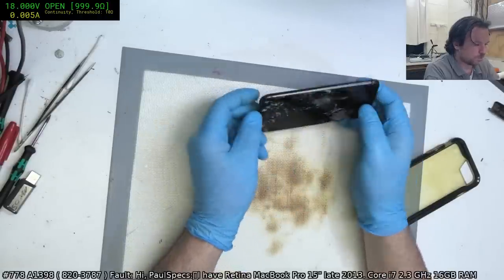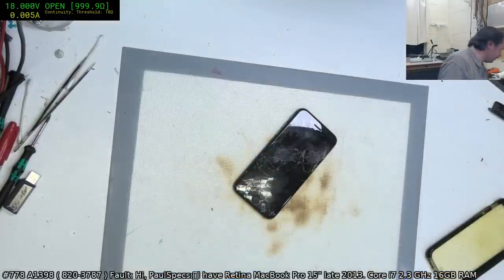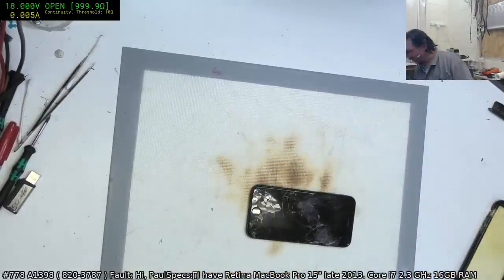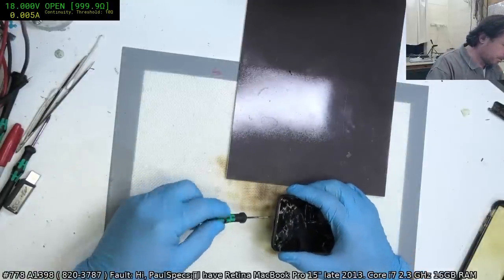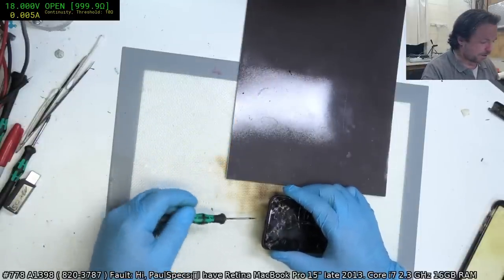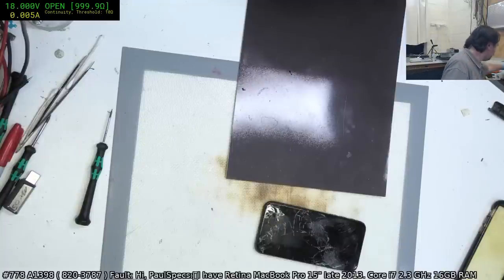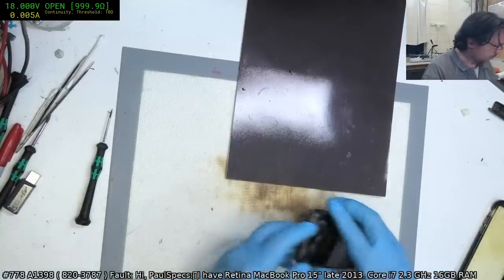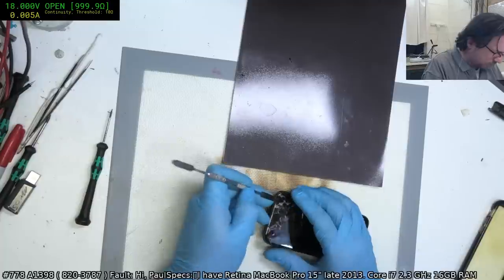The reason I say severe mechanical stress is because it's quite hard to get these frames to bend. I think they want data off this one because I suspect it's not going to work. I will not fire it up until I've taken that screen off, because I get too many people who damage their iPhone screens and leave them for a week or two before they get them to me. Then when I finally power it up after I've fixed things, it gives the dreaded "this iPhone is locked" response, and they say it wasn't like that before. But unfortunately, you can't express the sense of urgency sufficiently to people, and so they lose their data because they didn't heed your warning.